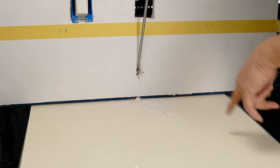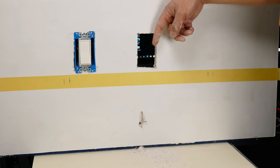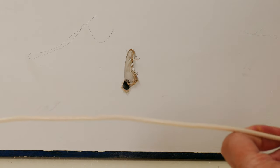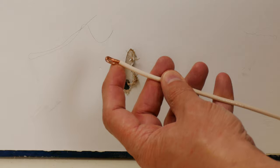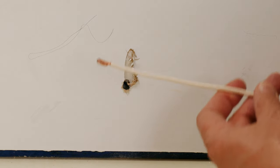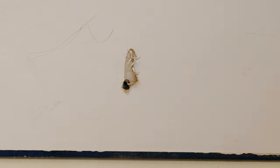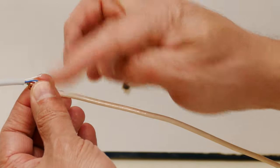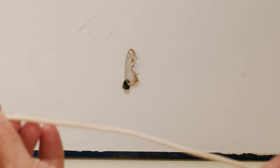Those are the techniques I use to get the wire up from the basement and into this outlet. Once you have the hole, I like to use standard 16-gauge electrical wire as a fish wire. I make a little hook at the end so I can grab whatever I want to pull through, feed it down into the hole, wiggle it around until I get to the hole I drilled, and push it all the way down to the basement. I strip off the outer coating, wrap the network cable through the hook, and use black electrical tape to connect it in a semi-permanent manner, then pull it through the hole.